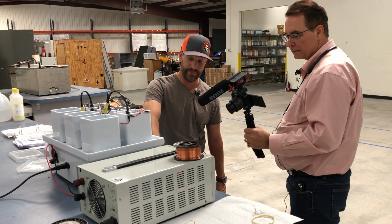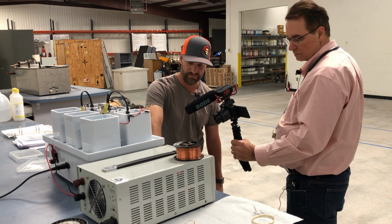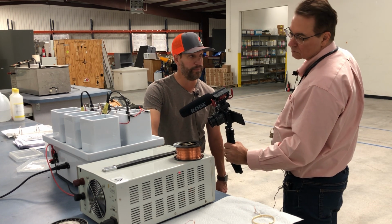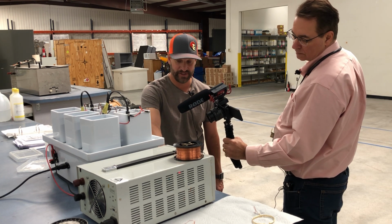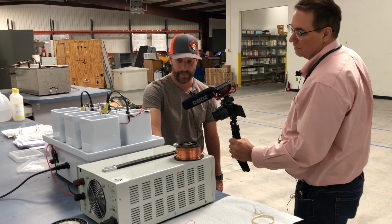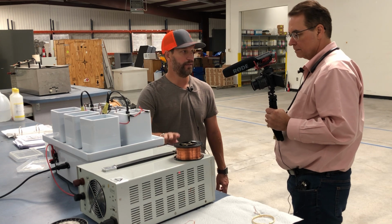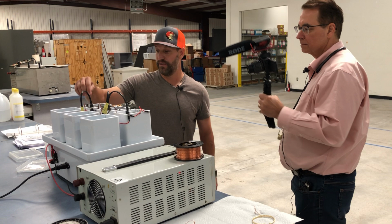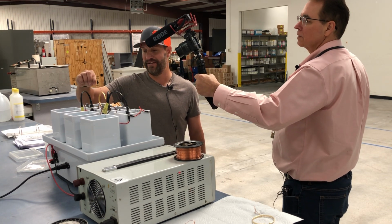These again are your temperature controllers for your heater. All you have to do is hit the temperature change here and it'll go to that point. If you want to save that temperature so that when you turn it on again tomorrow, you just hit set. When you first turn it on, is it at 0? If you've set a temperature, like this one was already set, it'll be 120. That's why it's important to turn those off, so that your heater doesn't just fire up in case there's no solution in there.